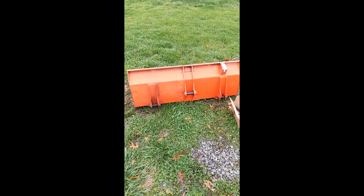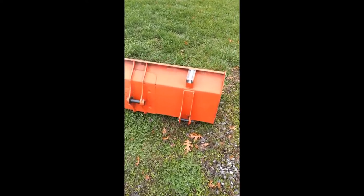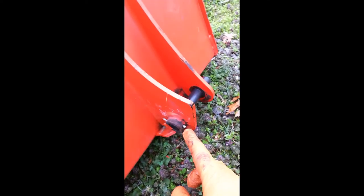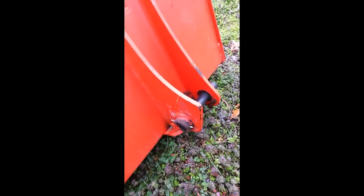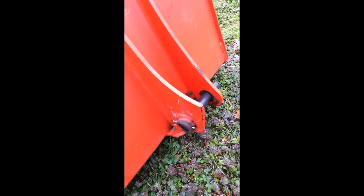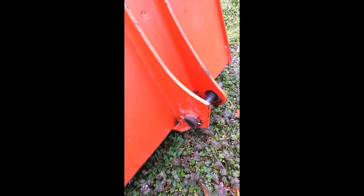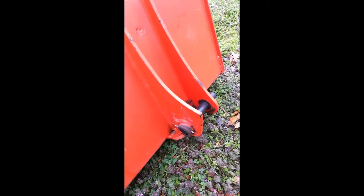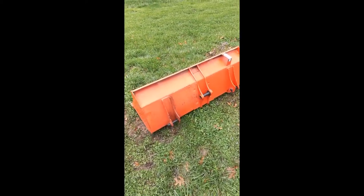All the pins are going back in and it's back installed. I did have to go find a couple of cotter pins to fit this part because the holes on the original ones are too small for a quarter inch bolt to go through. Just a note: get a couple of extra cotter pins — I think the length is about an inch and a half. The original bolts for the sides are a quarter inch bolt. I don't know if Tony machined them or if it's something you can pick up at the hardware store. The older BX style takes a pin on either side, but the center one fits perfectly. I still need to go finish the Quick Attach and put together the pallet fork — stay tuned.